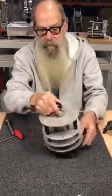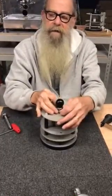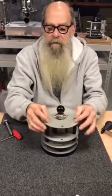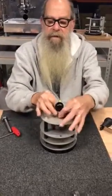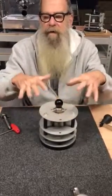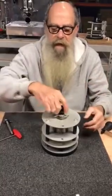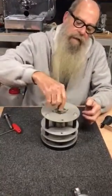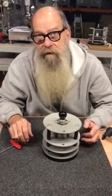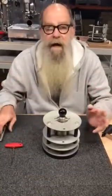Before I start, I check. These are not tight. These are all tight. So burr bolts are tight, assembly bolts are loose. These are tight with no wiggling, which indicates they're all approximately the same tension on that spring — the burr spring inside. By the way, these are like trade secrets that you're learning now. Six, seven years' worth that I've kept secret, but you get to hear this for the first time.